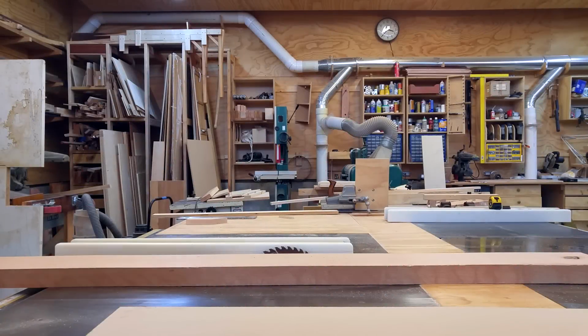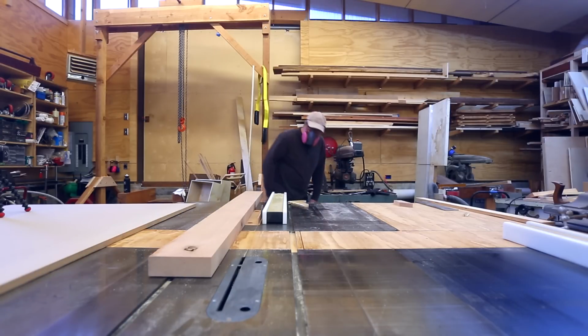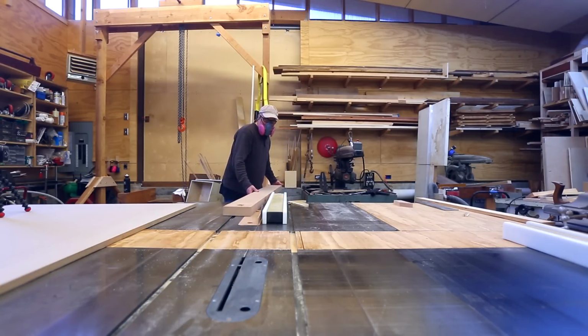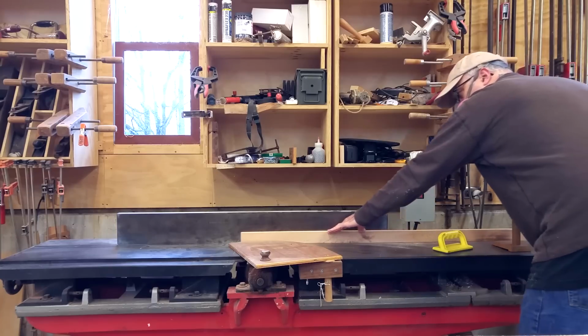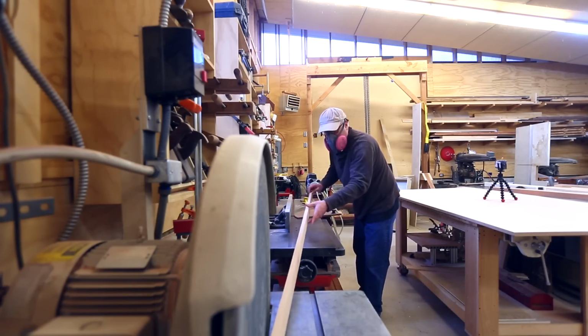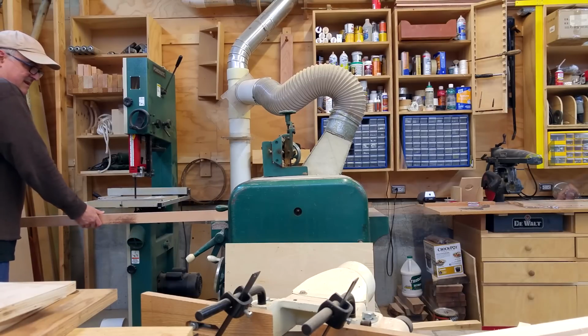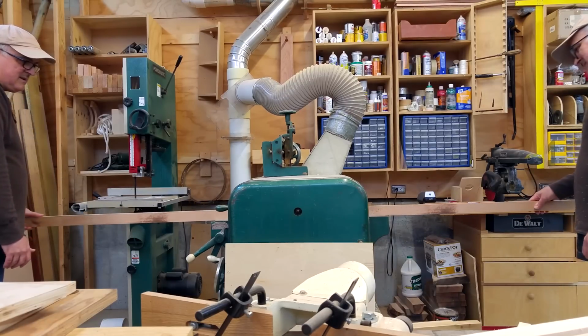To start, what I think I need to do is to make a piece of hardwood trim along the edge of the CNC table, which is made out of MDF. And this will do two things. It'll give me a good material to put the screws in for the hinge, and it'll give me a little more depth for the bracing for the back of the new vertical table.